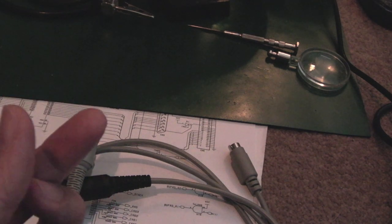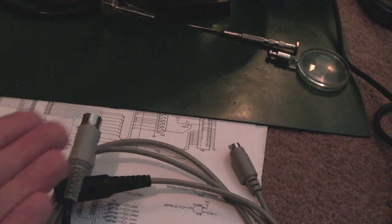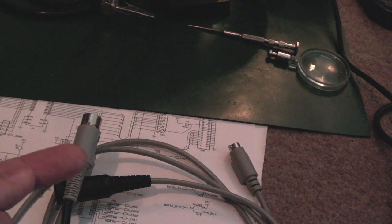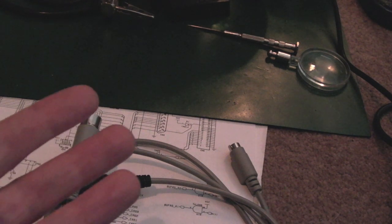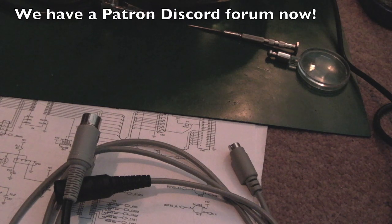In general, if you just get the pinout for the system you're looking at and use the information I've shown you, it's very easy to adapt from one Amiga keyboard to another system. I've seen people fit A500 keyboards in an A1200 — which may sound crazy until you consider the whole issue with membranes. An A500 keyboard will fit; just make sure you get those four connections and deal with your LEDs.